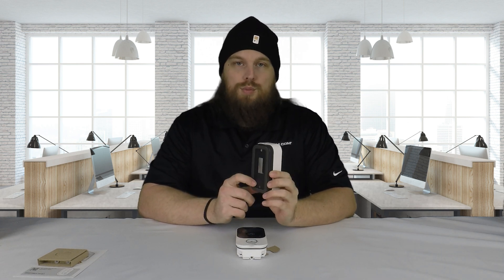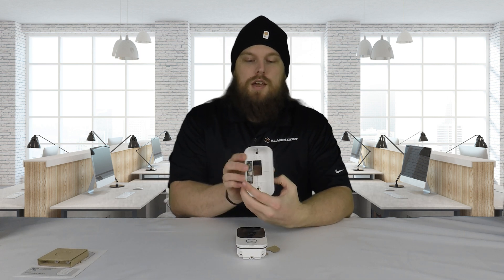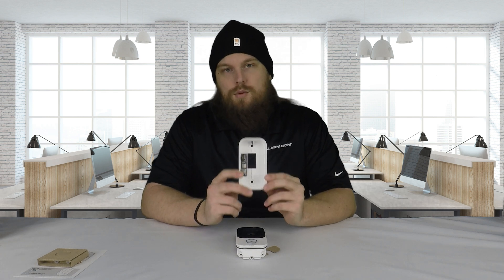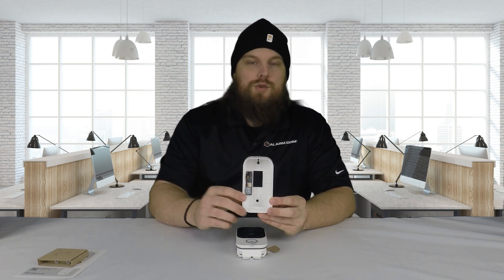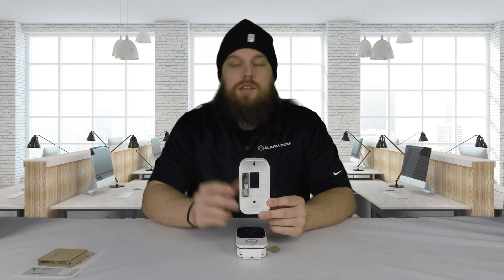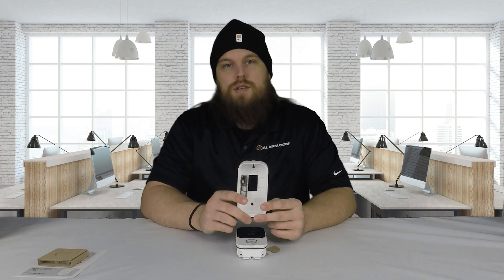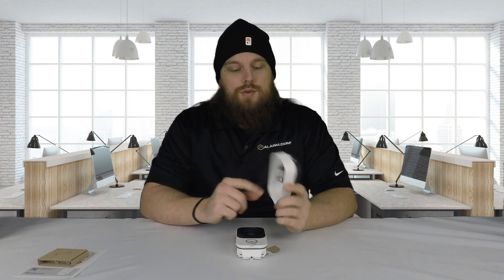This one uses a 150-degree by 150-degree viewing angle. You will want to take that into account when you're mounting this — you do kind of want to mount it on a flat surface. To my knowledge, this doorbell camera doesn't actually have angled plates like some of the others. The other Alarm.com cameras have a little plate you can put behind the backplate that changes the angle slightly — I think it's something like 10 to 30 degrees. So you can kind of angle it as needed with those others. However, this one just has the mount basically flat. So you may not want to do it on the door frame — you might want to move just to the side of that and go into the siding so that it sits perfectly flush against the wall. Unless you need a way to angle the mount, you could potentially come up with a solution, like a little piece of wood angled the way that you need it. Just make sure that you can still get that Ethernet connection to the camera, and you'll be good to go.